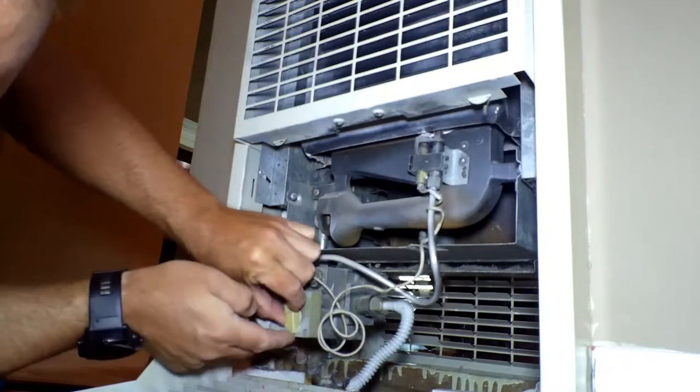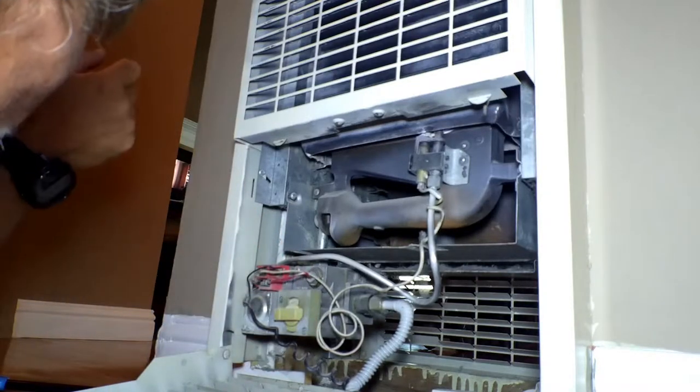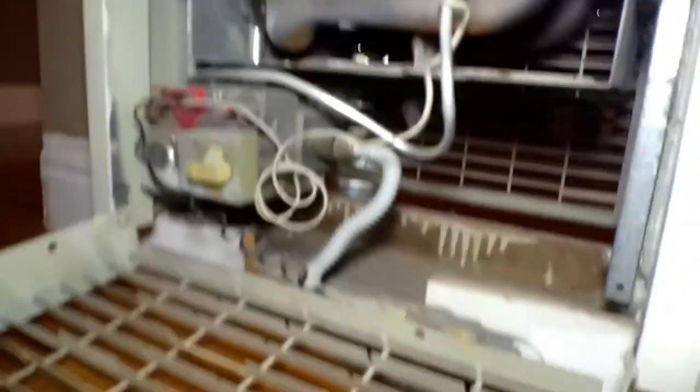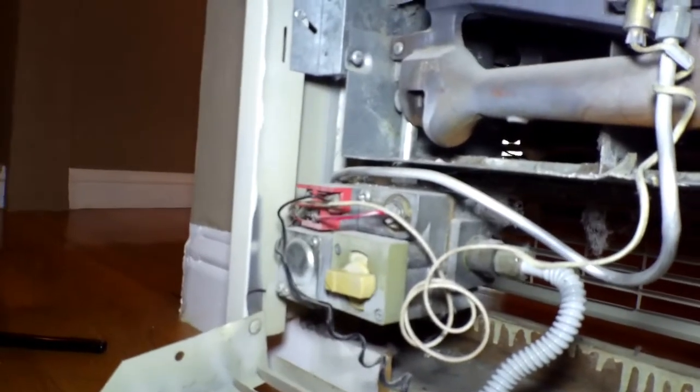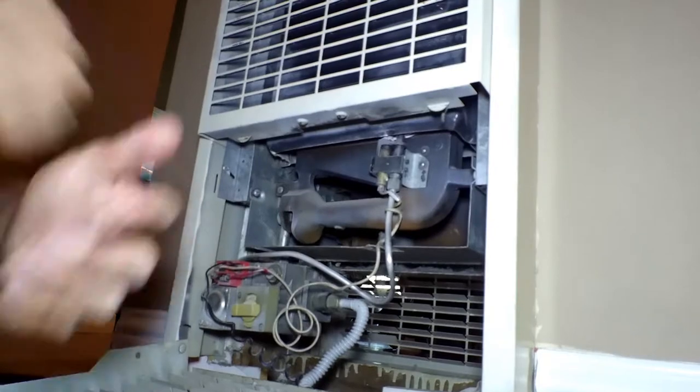So I turn it all the way. I come out and turn it to the on position. Now the heater is officially on. That's how you turn on a pilot. The flame is back — if you can see up there, there's the flame. The pilot is now in the on position. You don't leave it in the pilot position — you turn it to the on position. And that's how you turn on a heater or a water heater in the household.